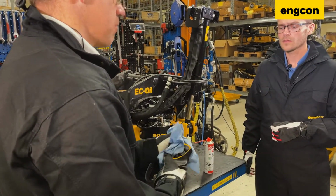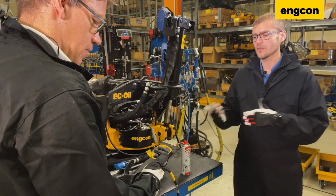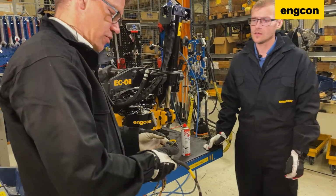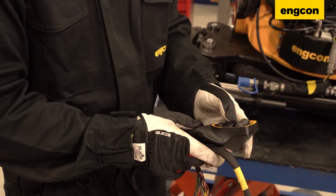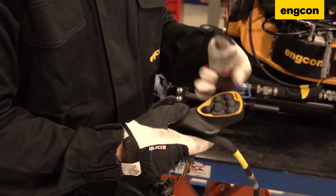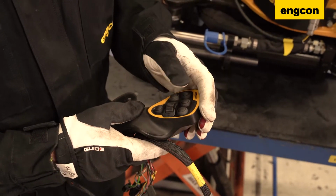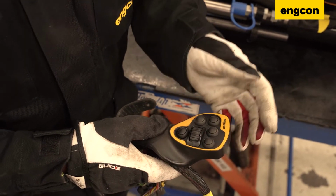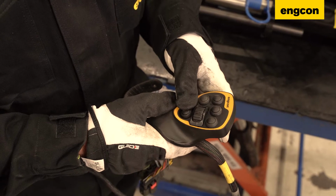as you want it. So what is the risk? I mean, if you have dust in the rollers and so on, what over time can that lead to? Well, the problem is when you have dust inside and then you have moisture inside, then this dust becomes mud, and then you will have this clogged up, and then the roller doesn't work as nicely as before. There's no actual electric contact surface which can get destroyed, but obviously the dust will be a problem. It's just more for the mechanical operation.